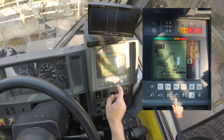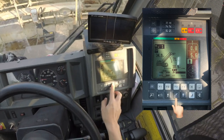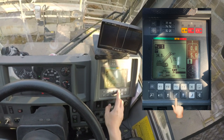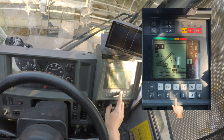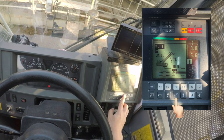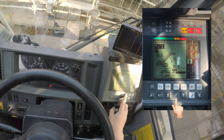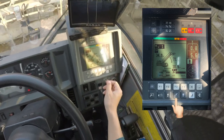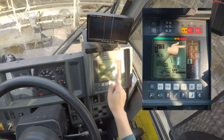The type of boom used, currently we're using the rooster head, small line. The auxiliary hook. The main hook, which is 4, the big hook. Jib setting. The jib, 10 meter jib, 3.5 degrees angle, 35 degrees angle, 45, the length 17, 25, 45. Now we're back to the big hook, auxiliary hook, enter. That's it.